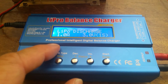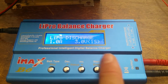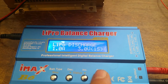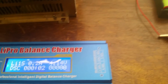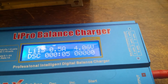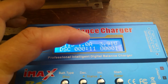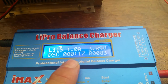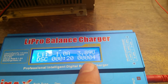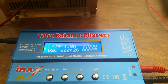Since I've got the battery loaded and I've got the mode set to discharge, all you have to do is hold down this button. It'll do a battery check, and as you can see, I got 4.14 volts to start off, and it is discharging. This is the current live voltage that it's reading, the discharge time, and then the milliamp hours that the battery has. I will record when it completes what actual milliamp hours I have.